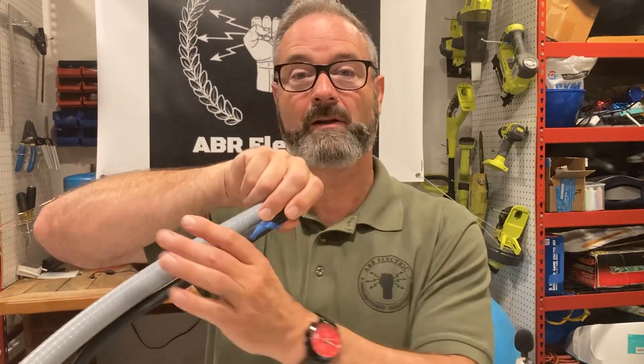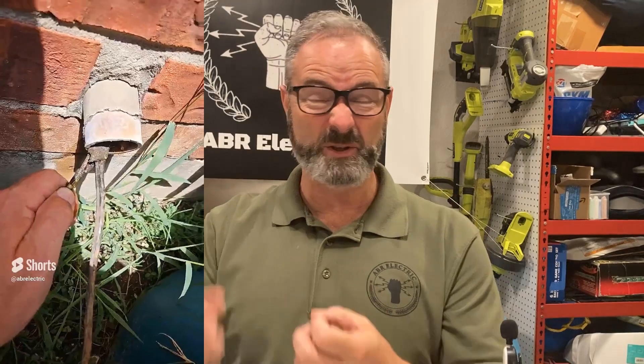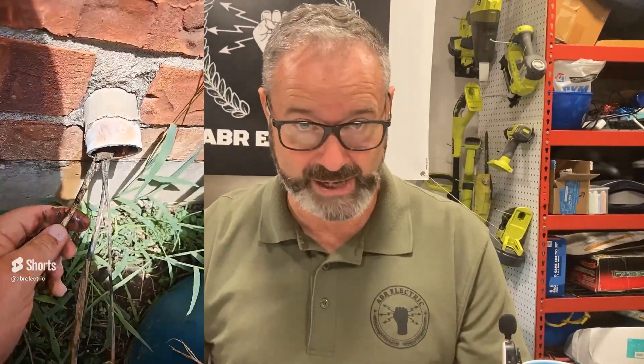So finally we're tracing it from the panel out, and I used my meter and ohmed out the whip — it's a Carlon whip, three-quarter inch Carlon, very similar to this, with I think 8/2 in there, and you'll see that in the video. I'm getting an intermittent short. I pulled the whip out of the J-box on the side of the AC unit, put my ohm meter on there, ohmed it out from ground to one of the hots, and I'm getting intermittent continuity — which you should never have continuity from ground to hot. So I start moving the whip around from where it goes into the wall, move it five degrees one way, and now I have solid continuity between ground and that phase. I'm thinking, oh my gosh, where are we touching? So I pull the whip and it just comes out of the wall, and then a bunch of this brown thick fluid — maybe it was water in the past — comes running out.